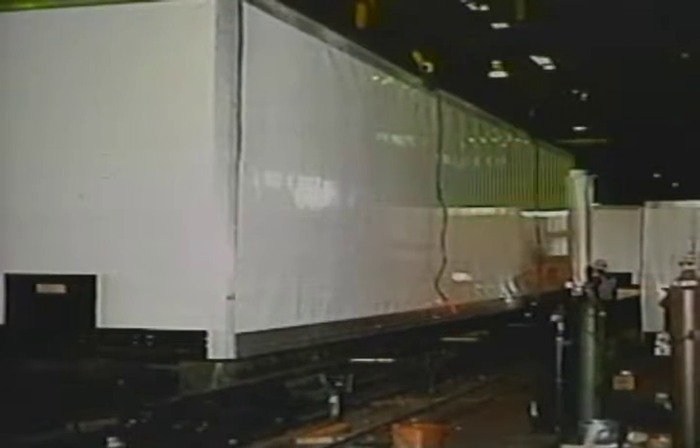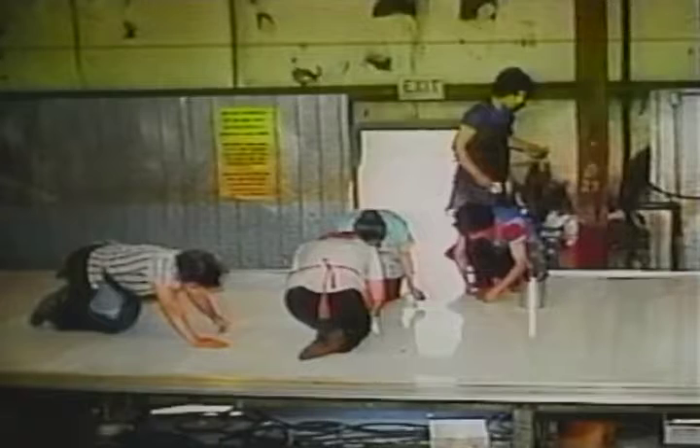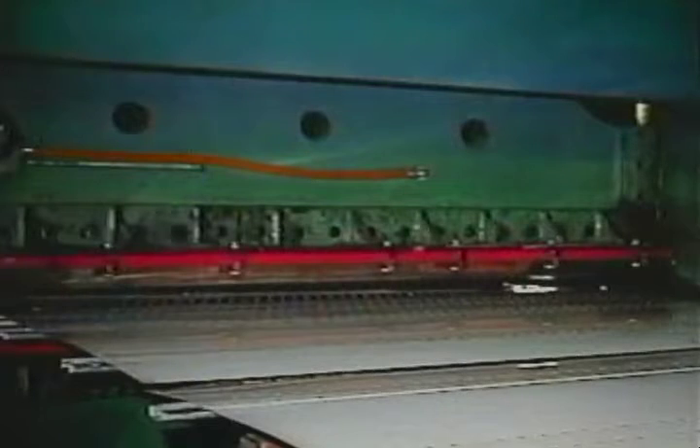Dry freight vans incorporate an engineering feature called semi-monocoque construction. A strong but lightweight van body is made possible by the interconnection of side sheets and side posts. The side sheets, or skin of the trailer, actually carry a good deal of the main weight and stress of the cargo. The side walls of the van are made by laying outside sheets on a large table over pre-positioned side posts. Rivets are manually placed in pre-punched holes, and the entire assembly passes through a large press which securely fastens all components into an integral structure.